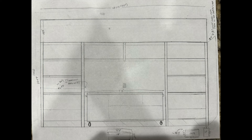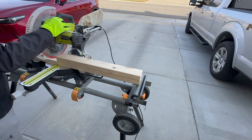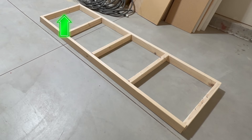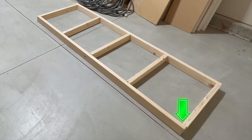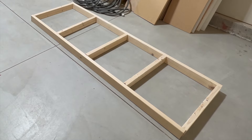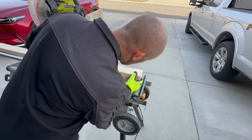Now on to building the shelves. I'm going to start with the top shelf first so I can make sure I get the correct distance down from the top of the ceiling. Because 163 inches is a long distance, I'm going to make two separate boxes, one for each side. Each box is going to be half that width at about 81 and a half inches. I've already made the measurements, so I'm going to chop up the wood with my Ryobi miter saw. The wood I'm using is just regular 2x4s. The structure of these shelf boxes is really pretty simple — just a giant rectangle with two long sides and two short sides. The short sides sit inside the long sides, and we'll make multiple cuts of that exact same length for outside edges and center support beams. I'll need to cut about 28 of those edge and center pieces for all the different boxes.